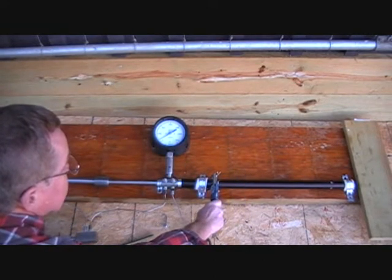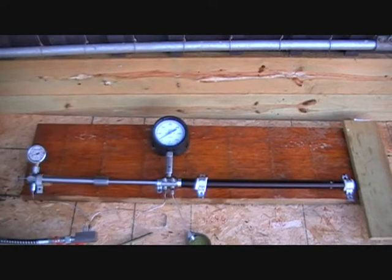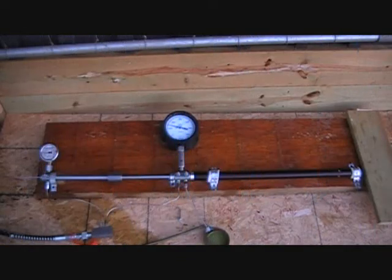We've had some growth, but we're still in the elastic region. We're going to take and boost the pressure back up. We're back at 7,000 psi and I have recharged the low pressure side.